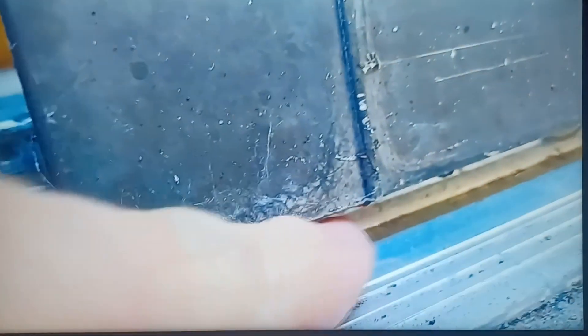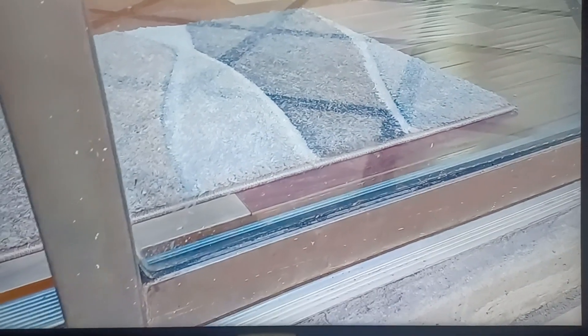You see that little hole there? You go in there with a screwdriver — flat or Phillips — and that's where you can adjust the wheel up or down. If it's up too much, the door is going to be too tight. If it's down too much, it's going to drag. Temperature also has a lot to do with how well they turn — heat causes expansion, cold causes contraction.